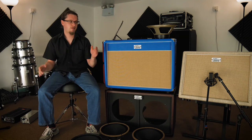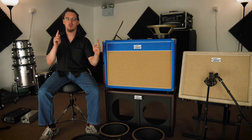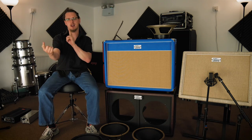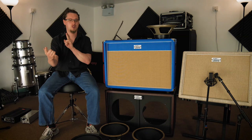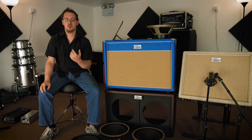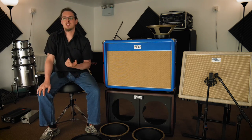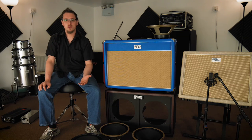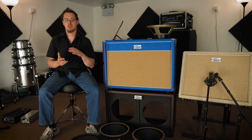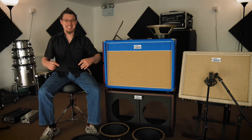I had to put it fairly close to the grill, because the end of a shotgun mic's barrel is the bit that cancels out the side audio, and the capsule is actually half a foot back, which means that, in theory at least, you shouldn't get as much low end into the tone. So just so you know, the gain on the preamp for this was on zero and it was not clipping, but despite the fact that the preamp wasn't clipping, it sounded like this.